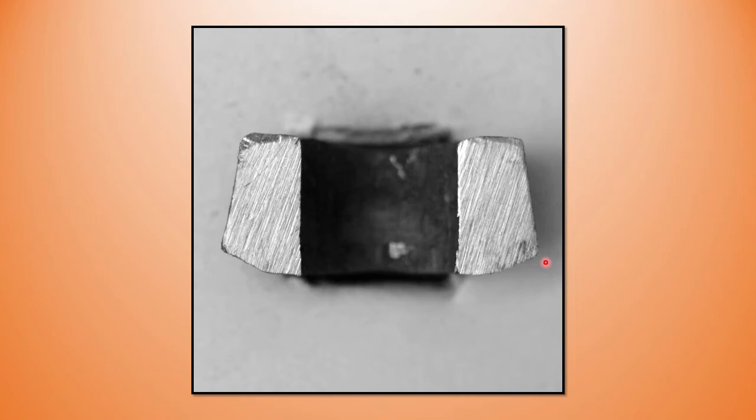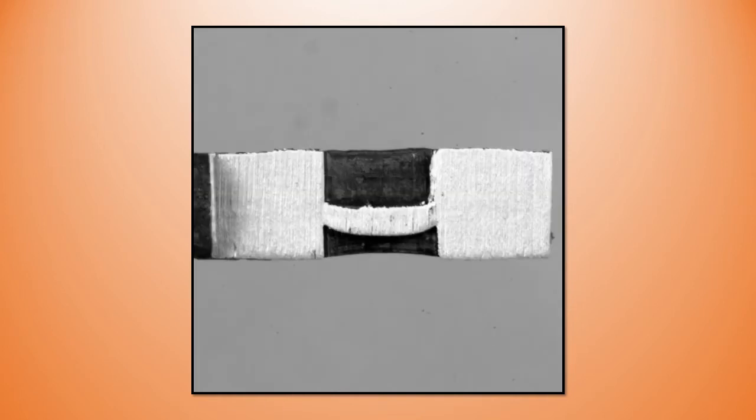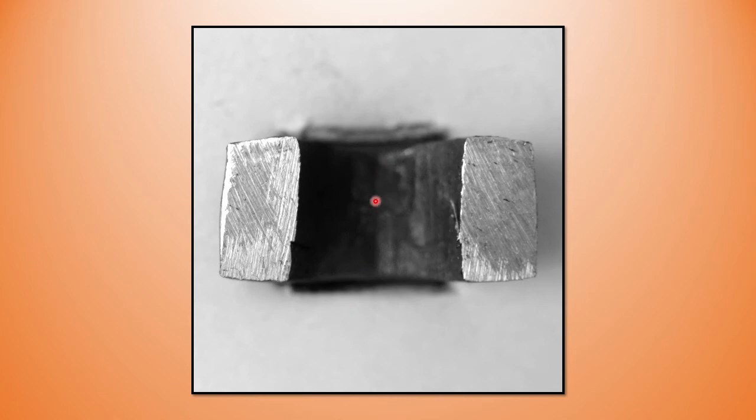Now you've got a problem because you've got to try and dress this to make it equal. I'm going to suggest we can have another go: if we punch towards the middle of the bar, all the surplus material is in the middle and we can spread the cheeks of the hammer to make it equal. Punch from both sides of the bar and meet in the middle — that's where the excess material is pushed. A hole punched from one side, turned over and punched from the other is very close to parallel, actually slightly barrel-shaped with a little more material across the center, and that is to our advantage.